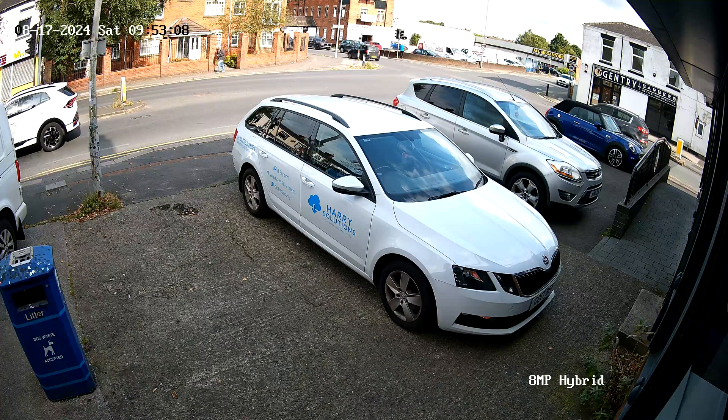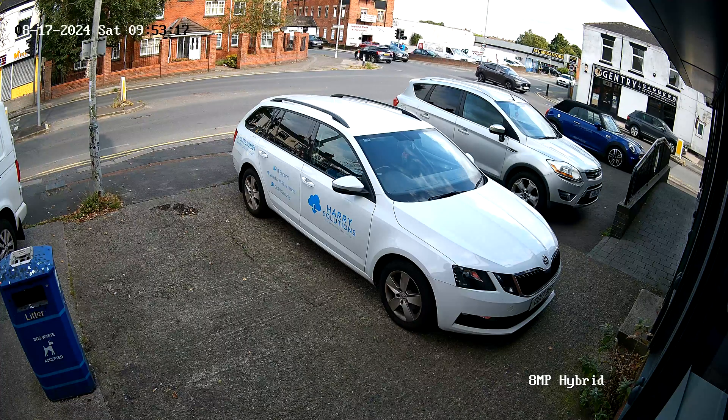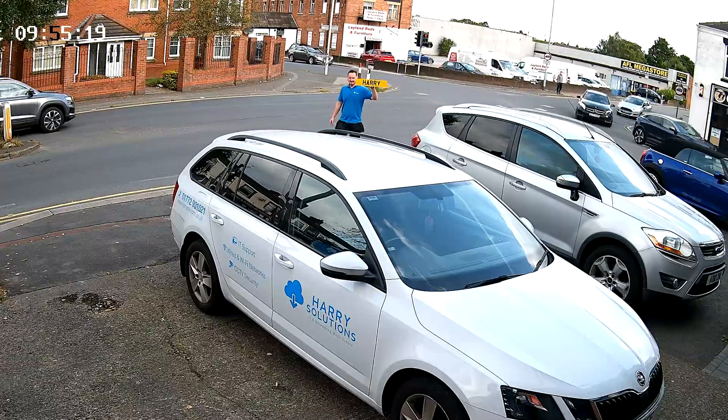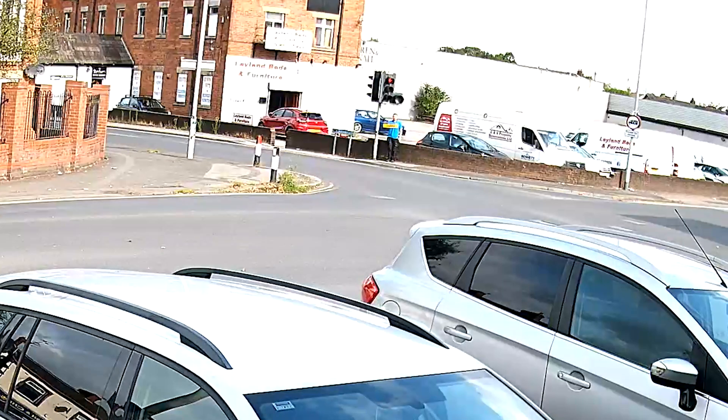But how does this camera perform in the real world? I've exported some footage off our NVR and you can see just how far CCTV has come. Everything looks really crisp, colours look really good — the reds look really red and the blues look really blue — and everything transitions through the image really well. Lower quality CCTV tends to suffer with stuttering, which comes down to frames per second — that's how smooth an object transitions and moves through video. I did a test where I stood at 15, 25, and 45 metres holding a number plate. At 15 metres I'm really clear, but I really start to drop off at 25 metres, and certainly at 45 metres you can barely make out the letters.